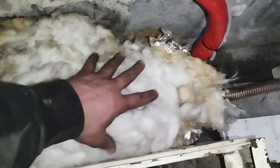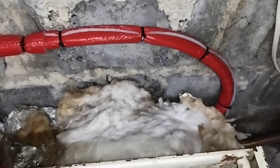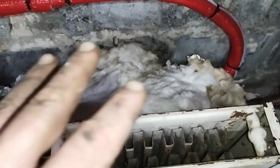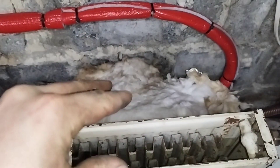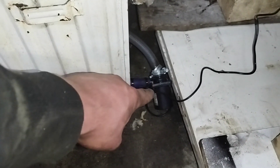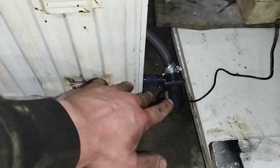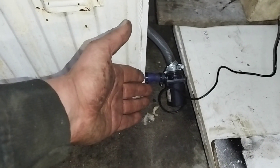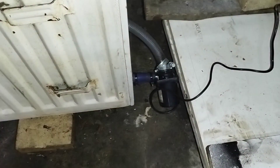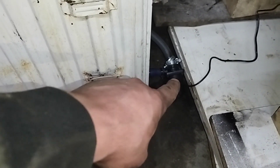Any water or anything created by cooling the hot exhaust will leak out outside. I also have some insulation that I am putting on the exchanger because I think it keeps the warmth in and lets the water pick up as much heat as possible. I have a 700 liter per hour water pump — it's the cheapest one I could find that had a 16 millimeter outlet, but it does its job.